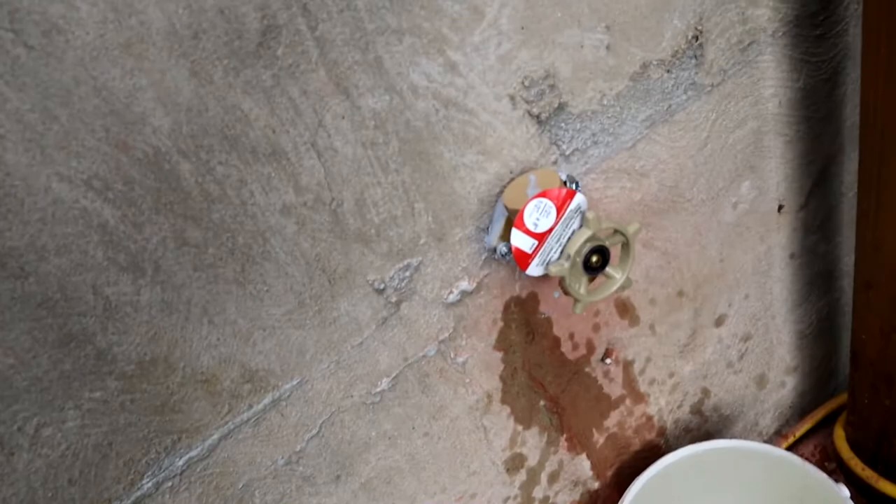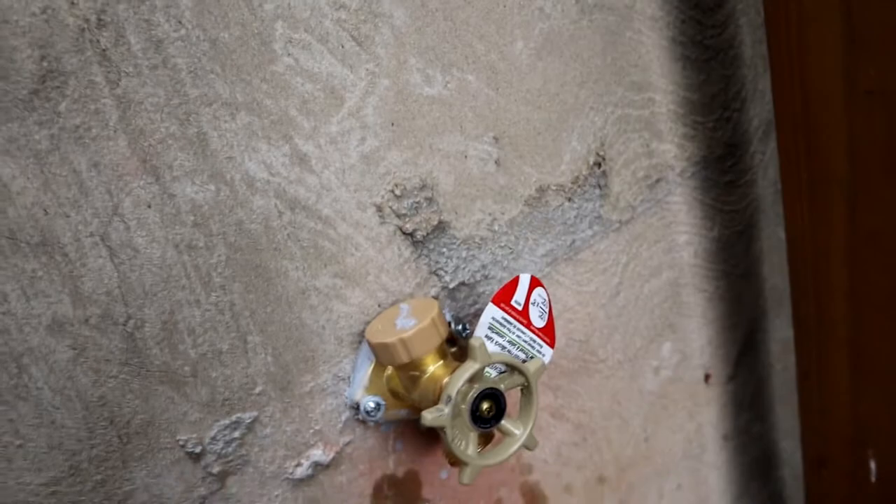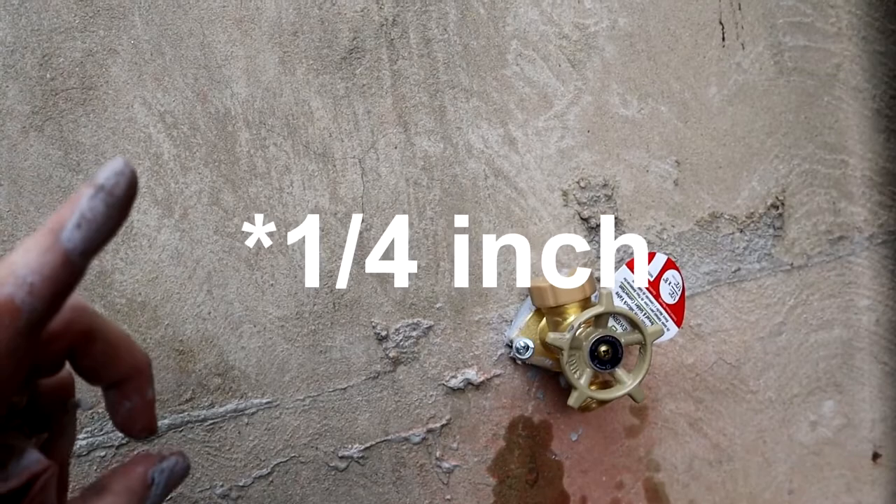It's so clean! All right guys — it's not perfect. I couldn't get these to stay in right. I don't know if I'm just using the wrong screws, but I did get it to secure and it feels mounted fine. I'll come back and clean it up later if I need to. The whole point of this is that yes — you can take a quarter-inch compression ice maker line and convert it with a T to your fridge to also run an outside hose bib. It's not perfect — it's not the craziest stream in the world — but I've already filled up that bucket testing it. It works great. I checked all the leaks inside and checked leaks here. This is awesome.